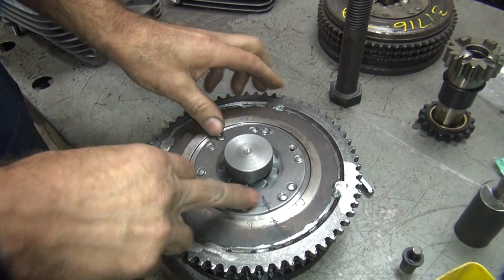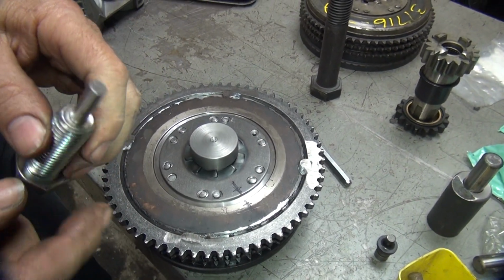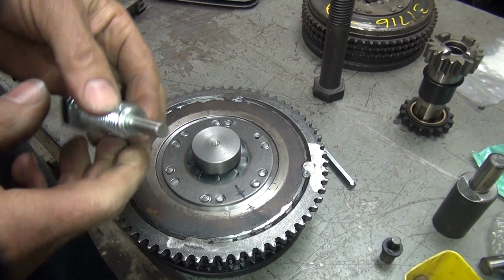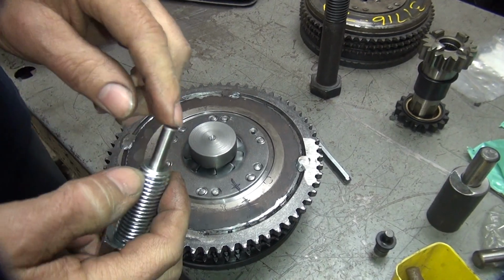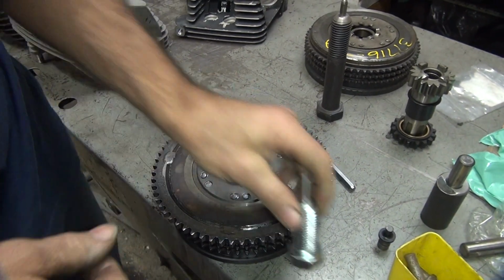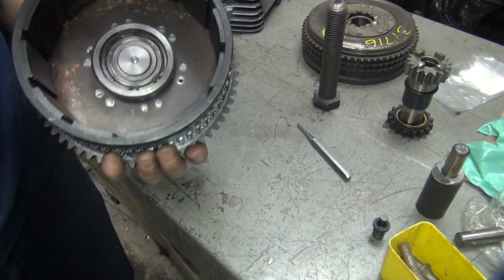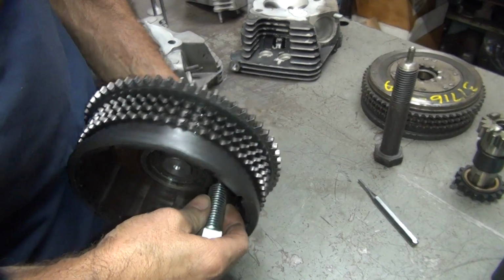Okay, we're working on doing this kicker ratchet gear in there. So I made up this holding fixture here, and that one locked in too. There's a long dowel pin here, a 2-inch long dowel pin. I just have it there, shave the bolt off flat so it sits flat. So this is our stopper. It goes on the back side over here, like that, and holds it.